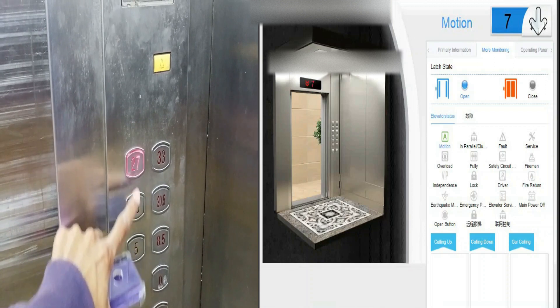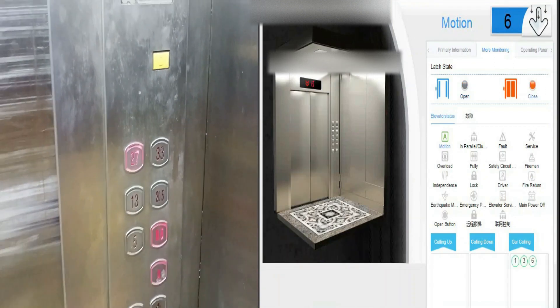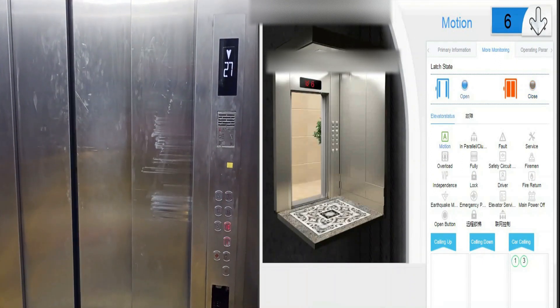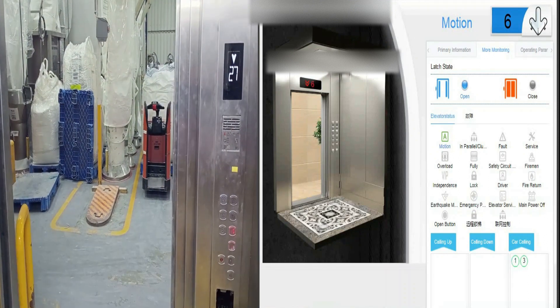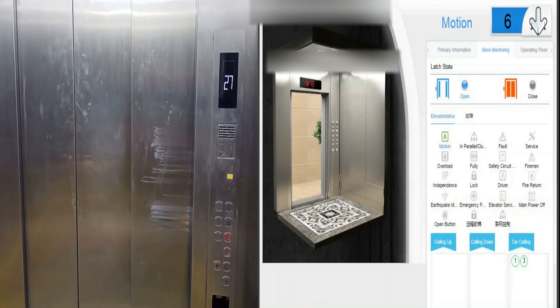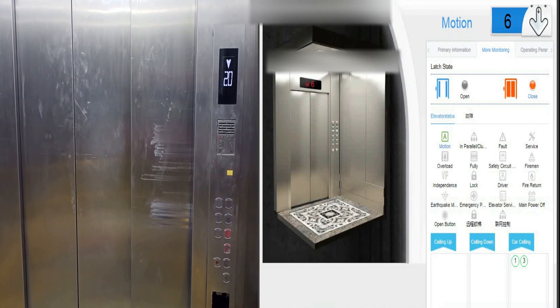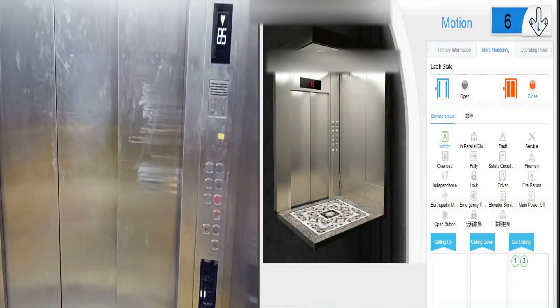In the same way, if we run the elevator in fully normal operation, a user behind a monitoring screen can monitor all the activities of the car. As you can see here, we have given different calls from COP, and the status shows that the car is stopping at their respective floors. Even when an IND or VIP button is pressed between the floors, that has also been reflected.